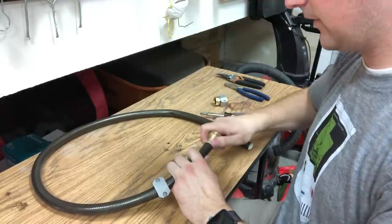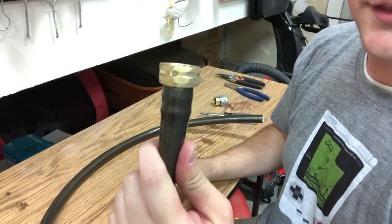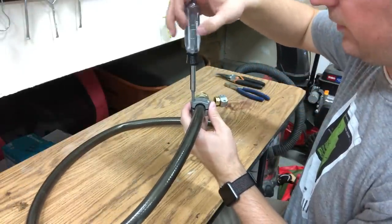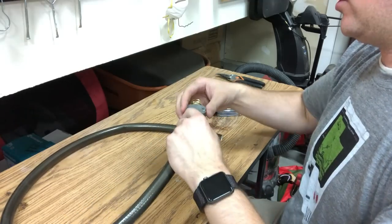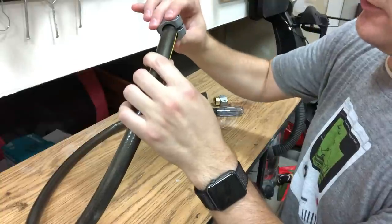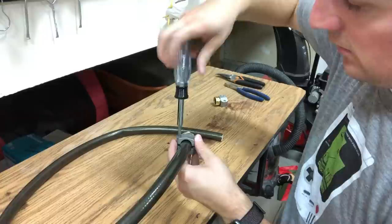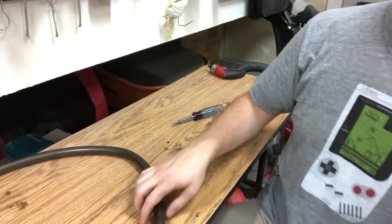This part goes into the hose. Push that in there all the way, as far as you can get it, and then bring the slip collar back up. You'll probably have to loosen it a little more — just loosen that up enough for it to slide over the end here. All the way up. And then this is going to squeeze down when we tighten the screws, creating a compression seal onto this piece here, holding it in place. Tighten this — do each side a little bit at a time. And that's what it should look like when it's all done. Nice and snug.